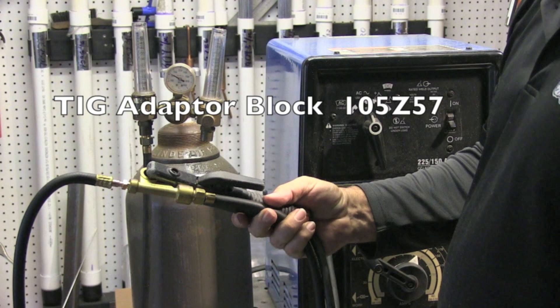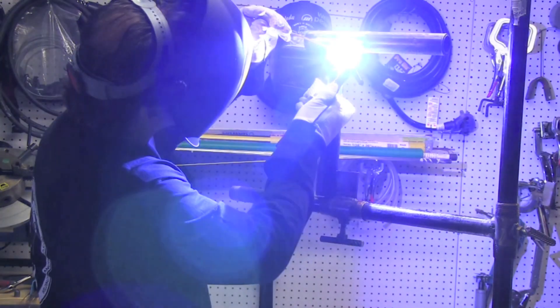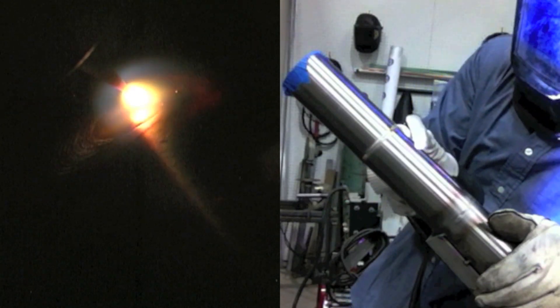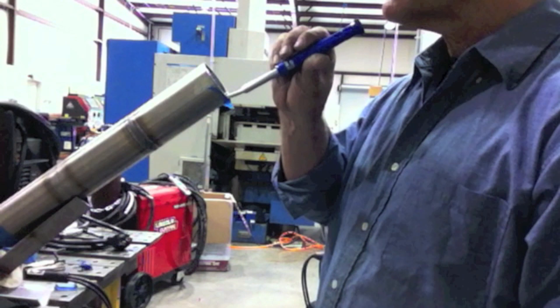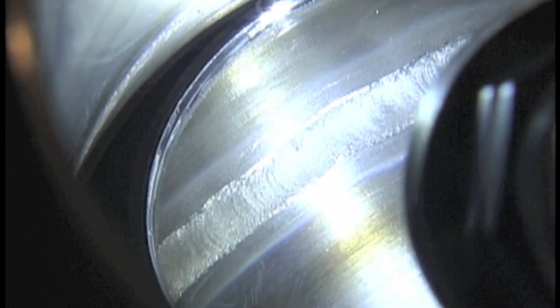If you do go this way, this TIG adapter block makes things really easy. A lot of handrails are welded like this. The good thing about scratch start TIG is it's so simple, durable, and portable. You don't have a foot pedal to worry about, so as you're walking around something or changing your balance when doing a 6G test, you don't have to worry about that foot pedal — it frees you up to stand and move around. It is actually used a lot for sanitary stainless steel piping. The challenge is snapping out of the puddle and maintaining coverage, but the main thing with sanitary piping is making sure the inside is purged with no cavities where bacteria might grow.